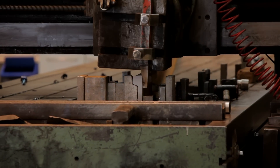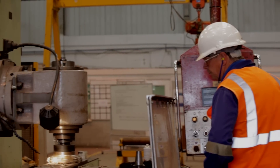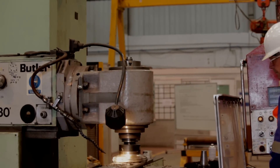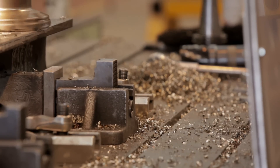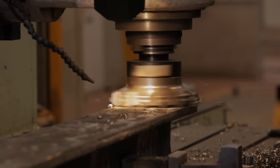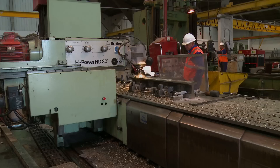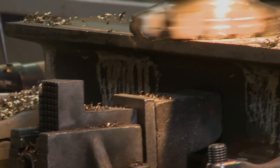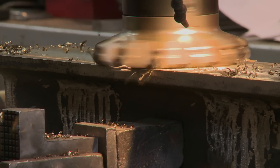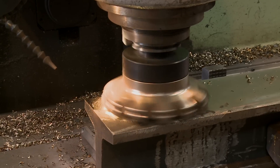While the planing machine slices down the original rail in long sweeps, milling machines grind down other parts of the same rail to more complex profiles, allowing it to fit into other parts of the switch and crossing layout. It's an Alga mill milling machine. What's special about this machine is it's got an indexing head that can work on any angle — vertical, horizontal, 45 degrees, any angle that's required.